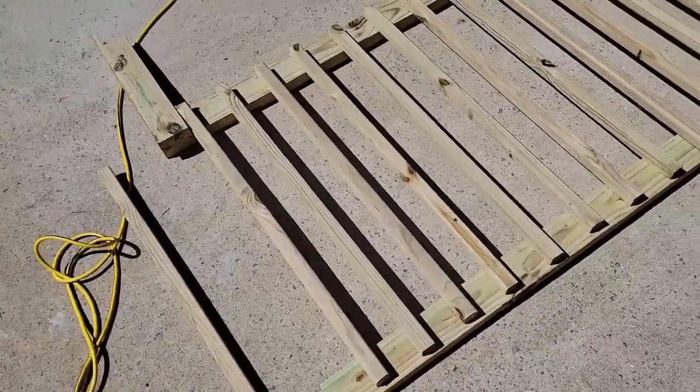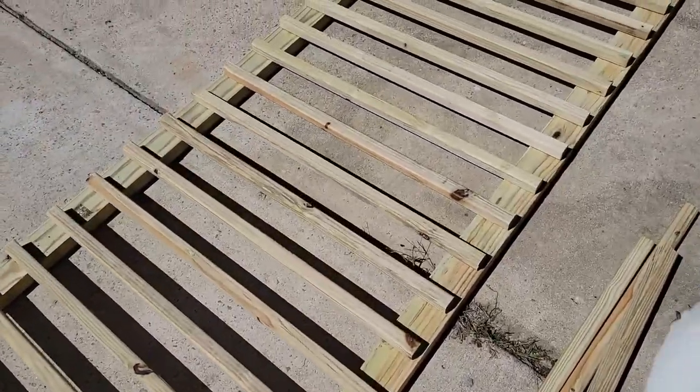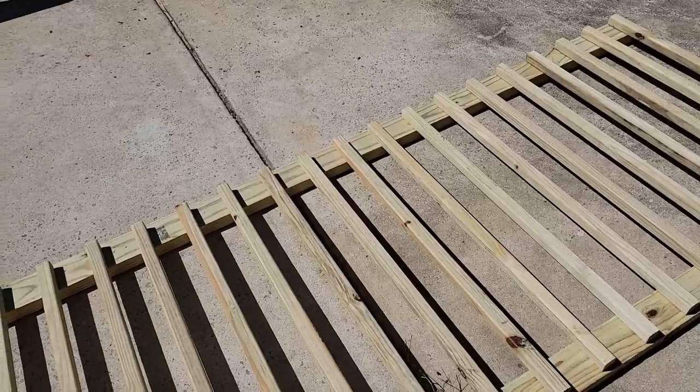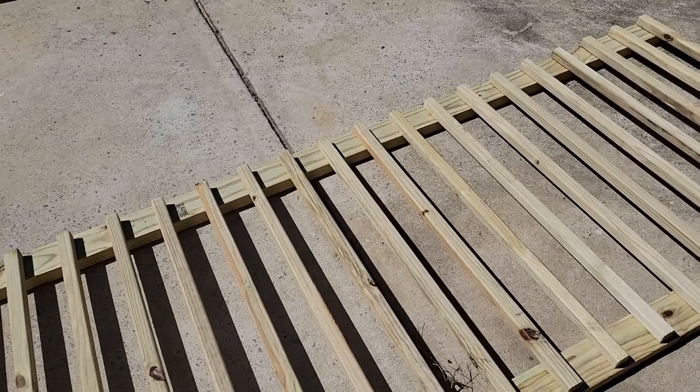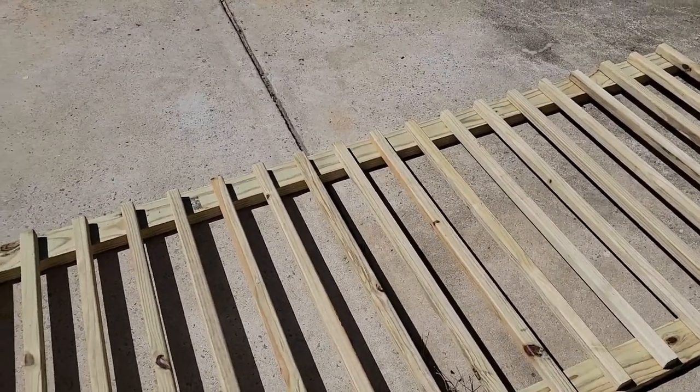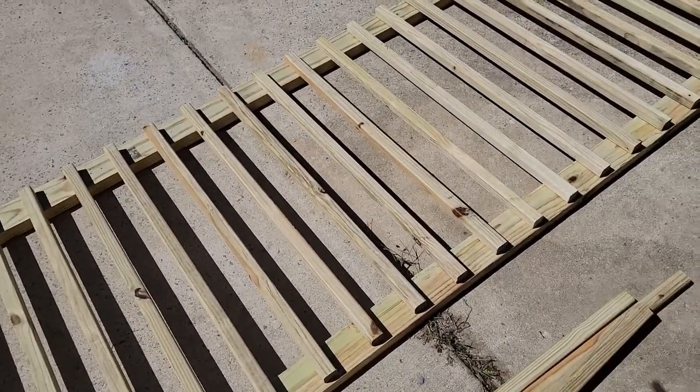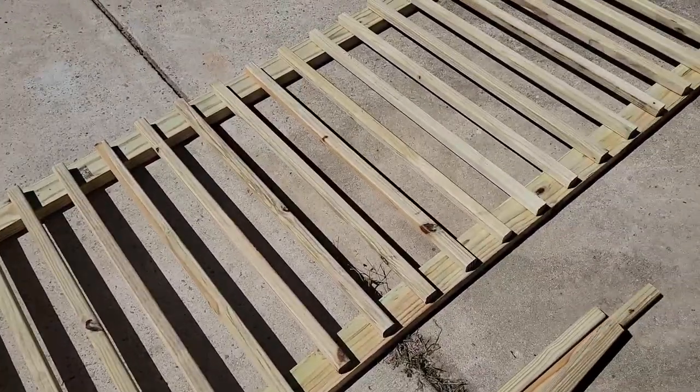All right, so as you just saw me do, I used the 2x4 method between the balusters to space them out. I started at the end. If you have a rail that's important, like when I do the back side of the house, the actual rail facing the yard, I'm gonna start in the middle and actually mark measurements out, make sure that there's even spacing to either side.